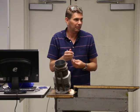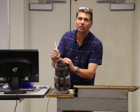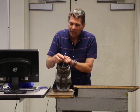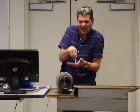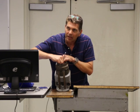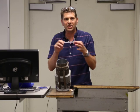Once it's my best guess perfectly in line, I tighten the little spring and take it out — but I don't stop there. I always do a check: I anchor the T-gauge toward me and try to pass it back through the cylinder, wiggling it through that circle. I'm looking for the spot where it only barely fits through and just drags a little bit. If you did it wrong, it'll fit everywhere in there. It's trial and error until you feel it anchor on one spot where it barely drags through — then you know you've got it right.